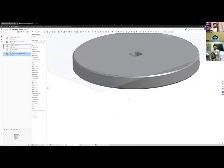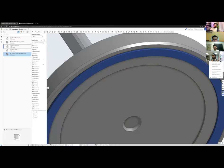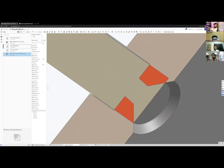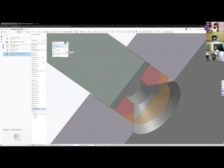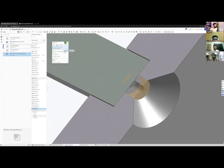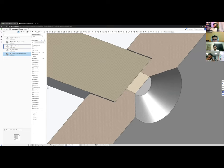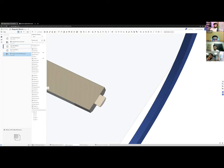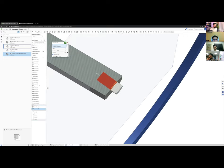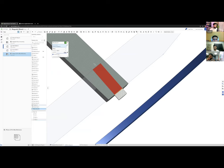The arm also needs a hole for the screw from the base. Using Section View, I can see the arm is slightly out of position — I'll move it back 4 mm. Then I thicken by 1 mm to create a new part, delete it, and move the top face to control depth — about 8 mm deep is right to stay away from the edge.